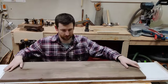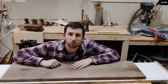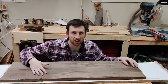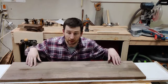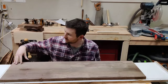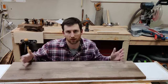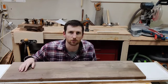And that's it — one nice flat board, ready to flip over and plane the other side. You don't have to worry about the entire board being perfect at this point, because you'll plane this side again after hitting the other side and flipping it. As long as you're spanning all the way across on the entirety of the board — this section flat across, this section flat across, and flat in the middle — even if you have divots in the very center, the planer will clean the rest up.